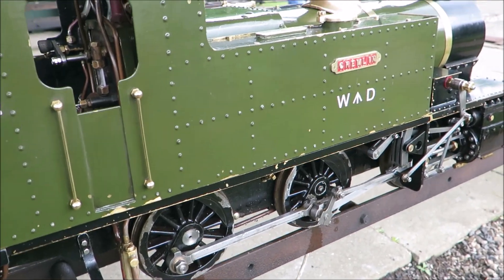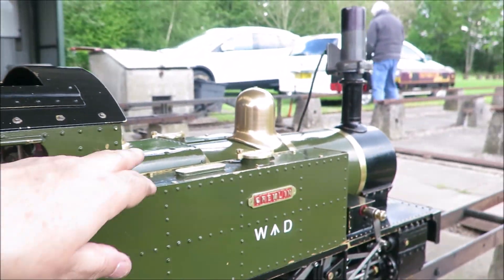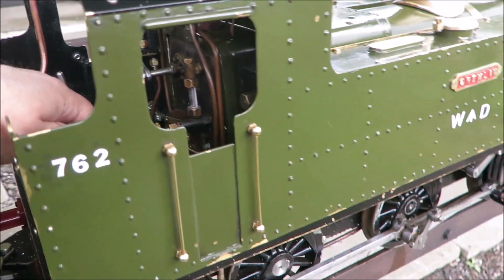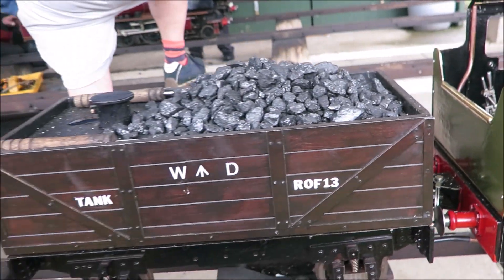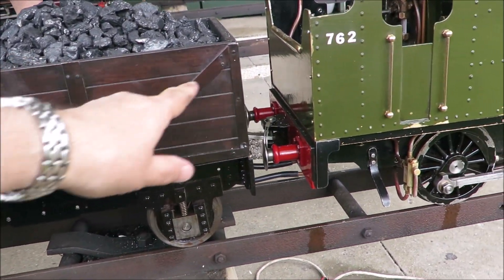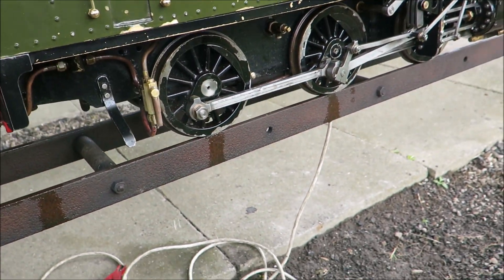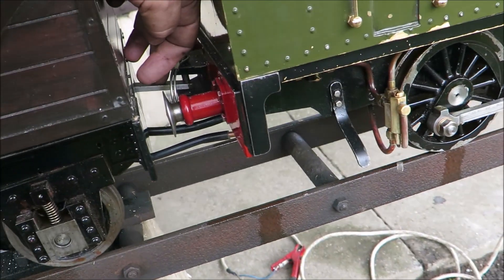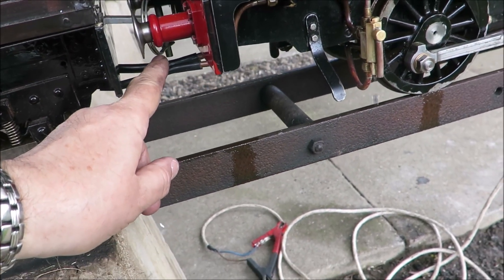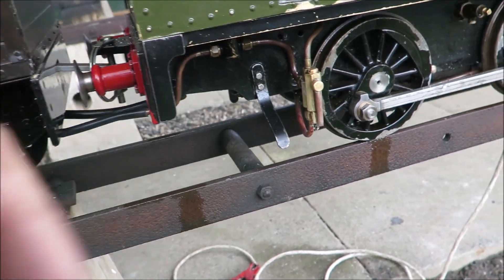Okay, this is me ready for steaming it up. We've got water in the tanks there. We've also got a bunker tank here, and we've got this cold-water tank at the back here — that's all water from there downwards. This is connected to the bunker tank from the centre pipe here, and the injector's got its own supply, so it's got a constant supply of cold water going into it.